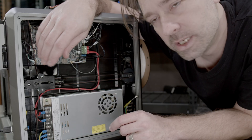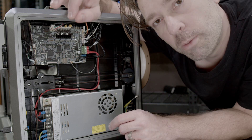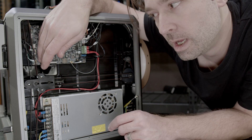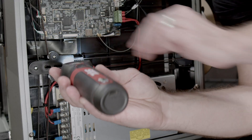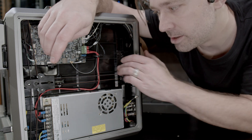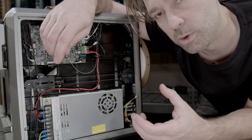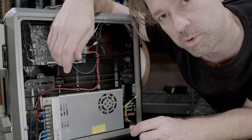We can see the belt tensioner that's incorporated in the belt system towards the front of the printer. What we need to do is completely remove the front screw facing the front of the printer from the belt tensioner, and the other screw we're just going to loosen so we can freely compress that belt tensioner. Keep in mind that those screws just go into heated inserts in the bottom plastic of the printer, so you don't want to over-tighten them or try to torque them too much — you'll strip those inserts and then you won't be able to tension your belt properly.